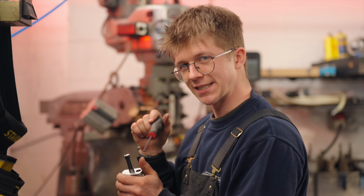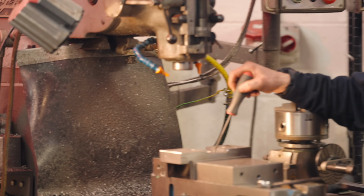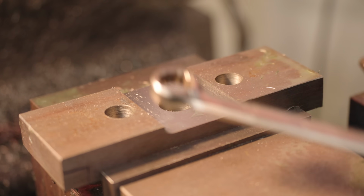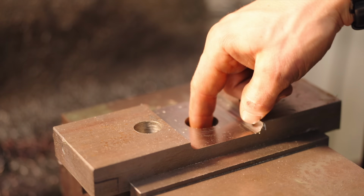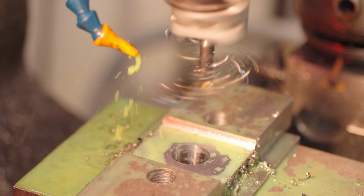Getting the boring bar set up. We've got 3 holes. We're looking at the underside here. This little recess is the clearance. They'll hopefully enable us to slide out the finished punched parts when they come through the actual hole. But see that? It doesn't look a lot like the size of a coin. It needs to be much bigger, hence the boring bar.